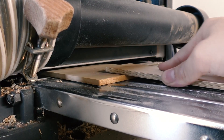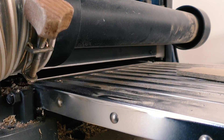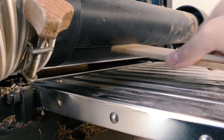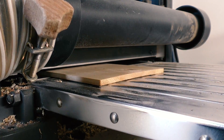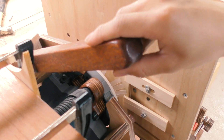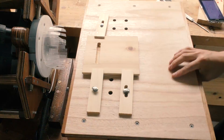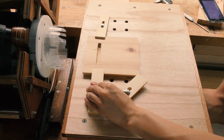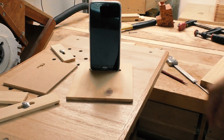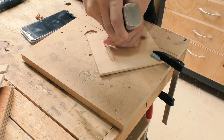I'm using a scrap piece of wood to press the work piece down as it exits the planer so that the ends don't get chewed up. This is because the work piece is 100mm shorter than the recommended minimum length. To cut this slot on the top piece to receive the phone, I'm going to use my bench router. It seems to fit my phone just fine. Although not necessary, I am squaring the corner.